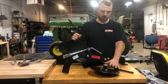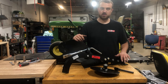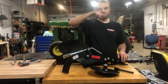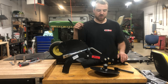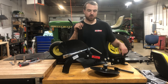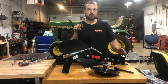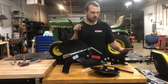The U-bolt for the holder here — I put the plow hitch in this position. The manual actually shows you which of the three holes to put your hitch pin, depending on where your wheels are spaced, which is quite interesting. On the old ones it doesn't really tell you that — it tells you how to adjust the plow, but not quite that in-depth. There are multiple adjusters: you can flip it upside down, move it from this hole down to this hole, depending on how you want to set it up on your tractor — it depends on the hitch, the size of the tires, and your track width.